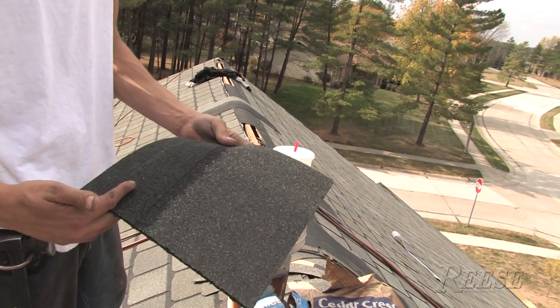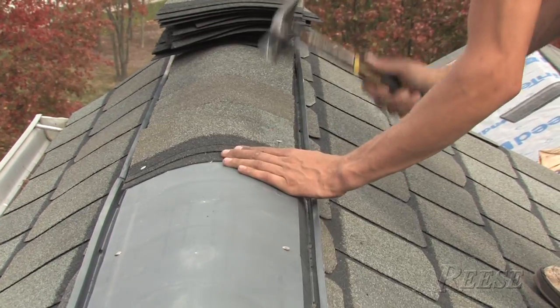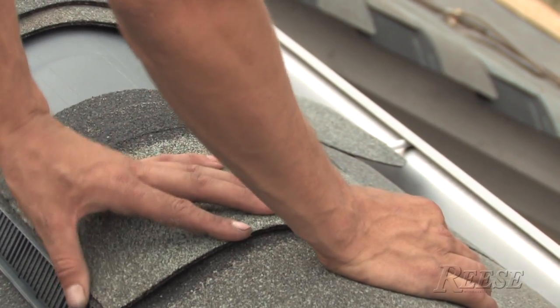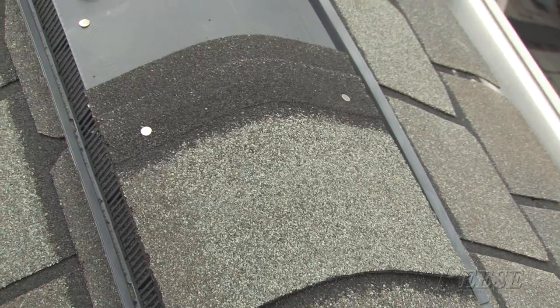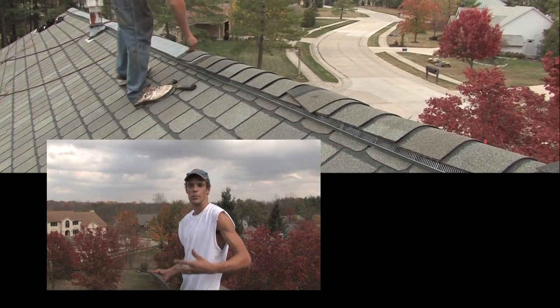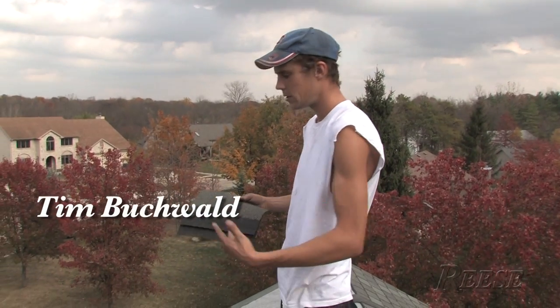You have your black shadow line — take it to this perforated line here, which makes a nice shadow line and raises it up a little bit versus their normal shadow ridge. It's easier to keep straight too because you've got that line right there to follow. Run it east to west because most of your weather comes from the west or the south — you're going the opposite way of the weather, so you have less chance of it leaking. This is where you put your nails.